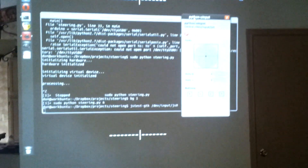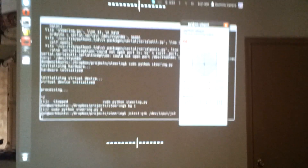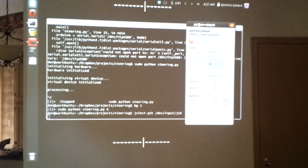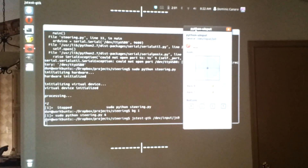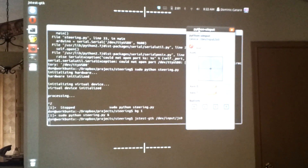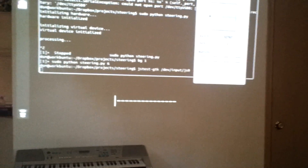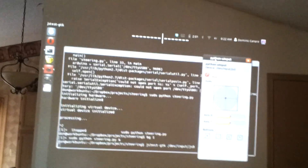I've got on the laptop a Python script that I threw together. It takes serial input from the Arduino and basically outputs it as a virtual joystick — software on the operating system sees it just as another joystick. So the handlebars control the x-axis of the joystick, and the pedals control the y-axis.